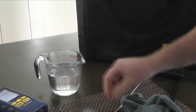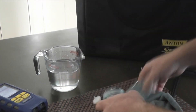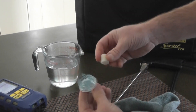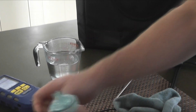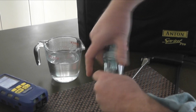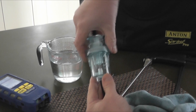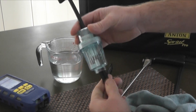So if we give that a quick dry out — I've got the PTFE filter there that we take out, just blow that through. Then in the top section of the filter bowl, that just pushes back down. You've got your holder for your particulate filter, that pops back on there, sits down there and just locates. Pop that back together. You'll notice the whole design of the filter bowl has been reconsidered. We've made this out of the same materials used for crash helmets, so it's very robust. The central nut is designed to act as a bumper if the filter bowl is dropped, so we expect this to last a great deal longer.